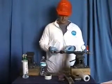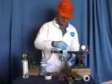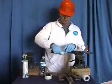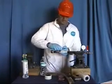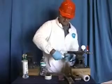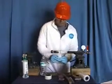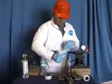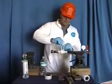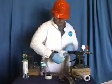We're going to apply over the repair site. We're going to apply the composite wrap in the same direction that we applied the pressure sealing tape. I like to start the composite wrap on the top, so I secure it in place. We're going to focus the materials over the repair site. I want to utilize a 50% overlap, pulling tight, securing the materials over the repair. Pull tight, locking the materials in place, focusing on the 50% overlap.